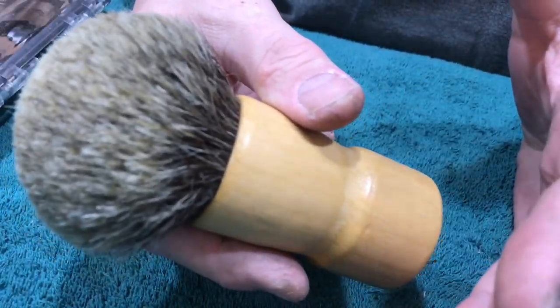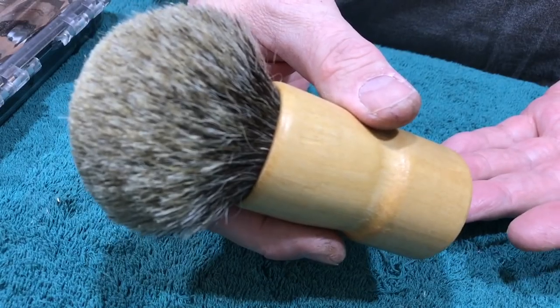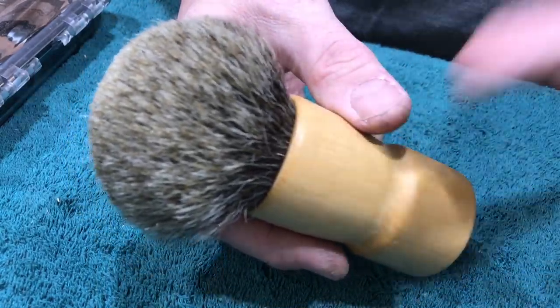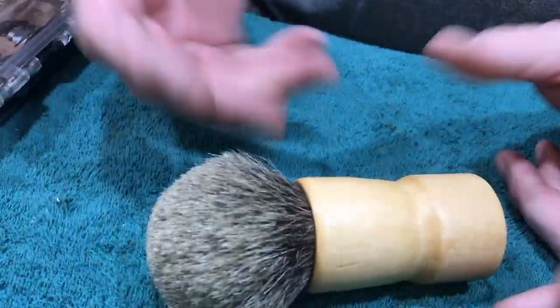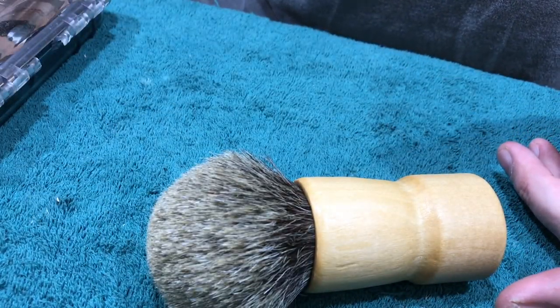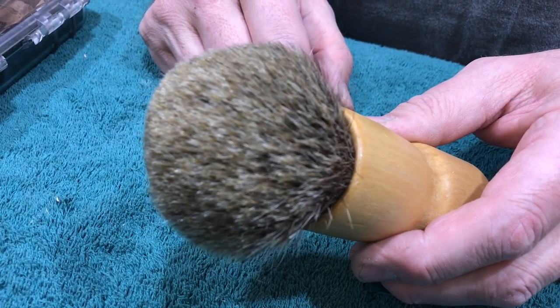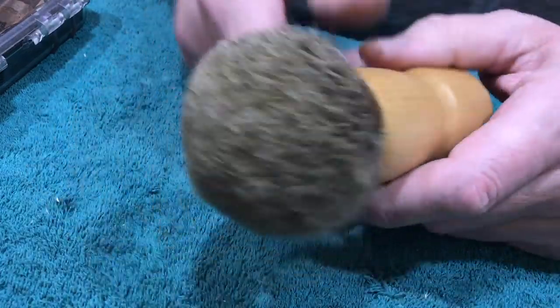Okay, they were just basically slapped together. So you don't have to slap it together, but you don't have to sweat the small stuff all the time. If you read posts on the internet, people talk about this stuff like they're weighing the amount of glue and the density and the Shore hardness of the release. If your adhesive is going to cure to something over Shore 40, it's probably going to be fairly permanent.